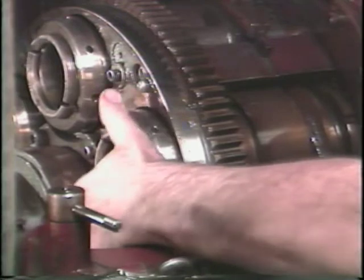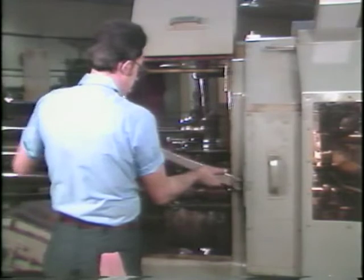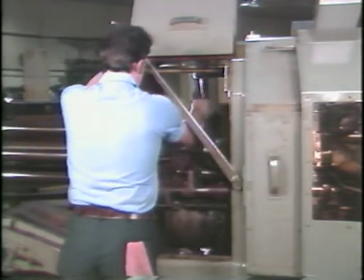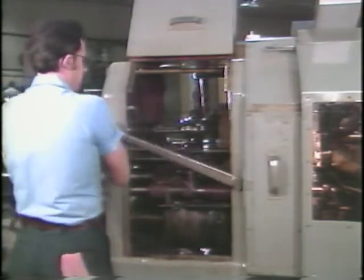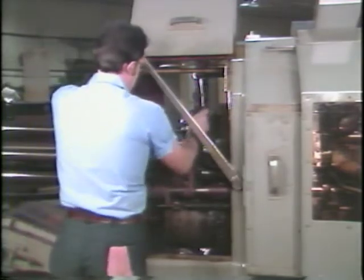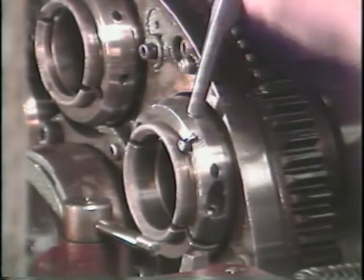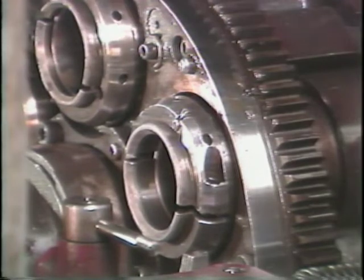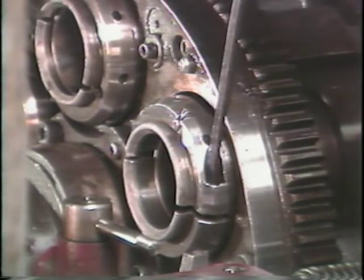To adjust the collet tension, place a bar of stock of the proper size into the collet. Using the chucking handle, open and close the collet as you tighten the collet adjusting nut. Once the right tension is found, drop the locking pin and tighten the adjusting nut until the pin drops into the locked position. Tighten the Allen screw to lock the collet adjusting nut.